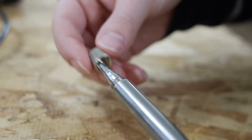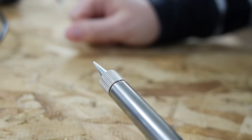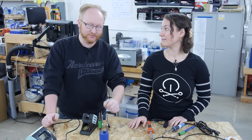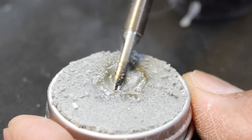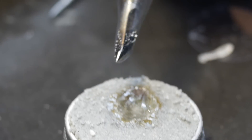Once you've selected your soldering tool, you'll want to make sure you get some spare tips. It's really important to have a good clean tip when soldering, and as a beginner it's easy to accidentally corrode and ruin your tips. You might also want different tips for different applications — like a finer point tip for detailed work, or a larger tip to transfer more heat quickly. Felix has been using a tapered blade-style tip, which has more surface area and heats pads really well.